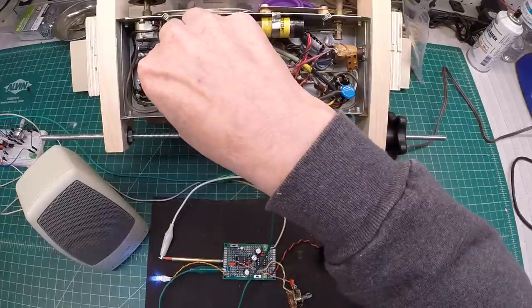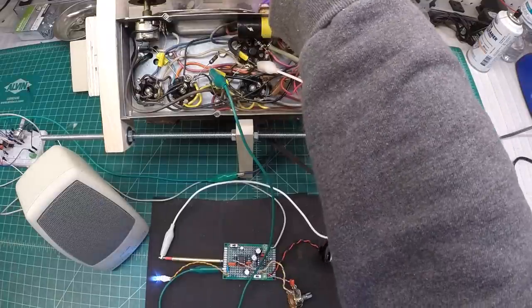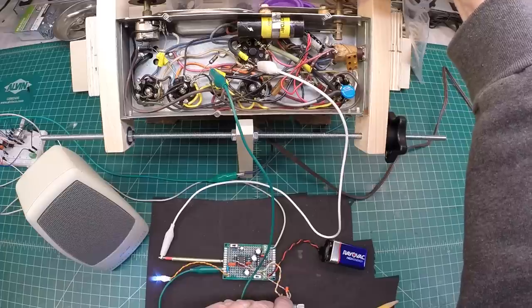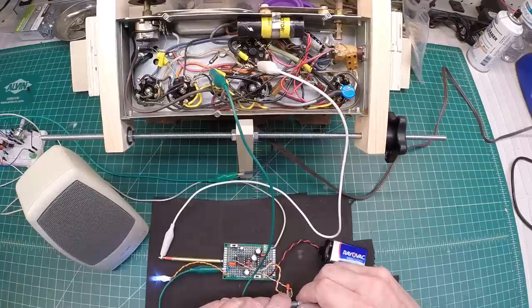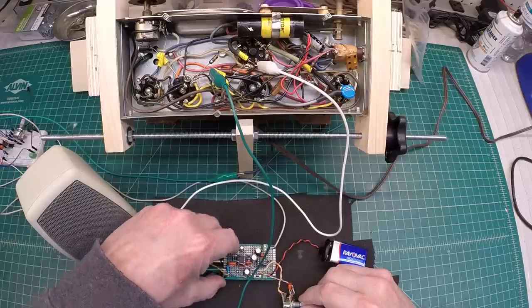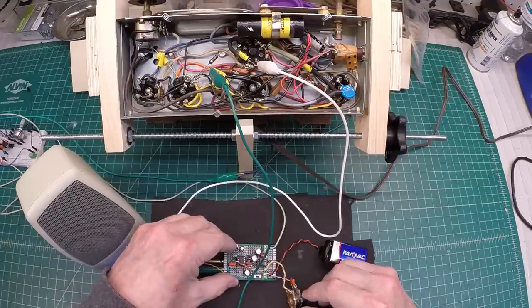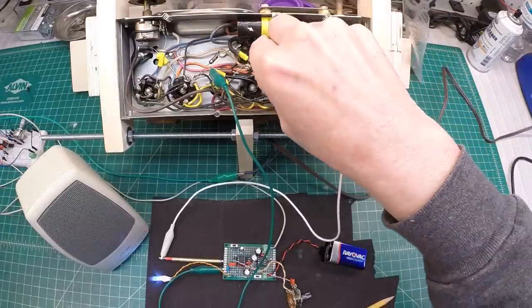Let me go back over here to the grid itself. I'll have to turn the volume up just a bit, of course. I'm going to flip the gain switch again to see the difference. Then I'll turn the volume down just a bit more and swing over to the plate itself of the tube, demonstrating signal tracing through multiple stages of the radio circuit.